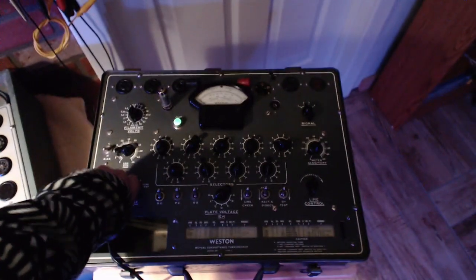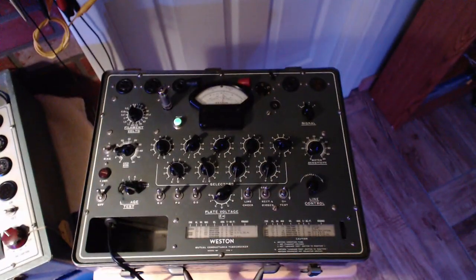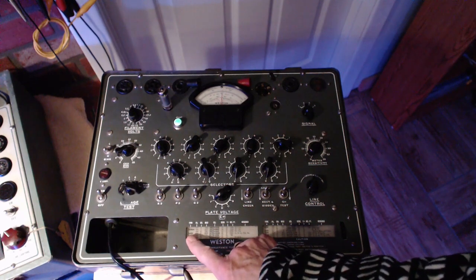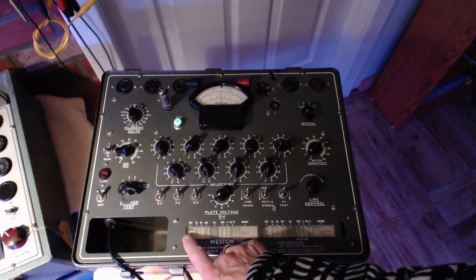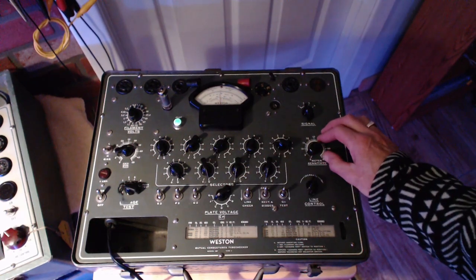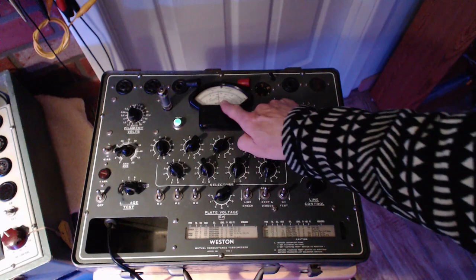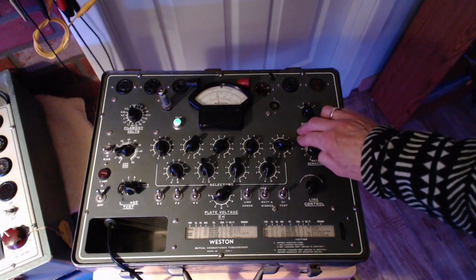Any shorts in that tube? So this tube is showing a short on 1. Now that could just be a normal thing. So this is a 6AQ5 setting here, and it's a 6AQ5A. Normally I wouldn't think there's any particular difference. So now we're stuck here with this tube tester telling me there's a short in this, but it's not a dead short. It's 200,000 ohms.